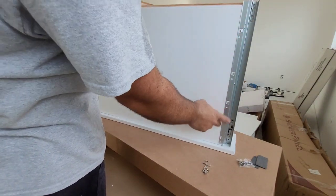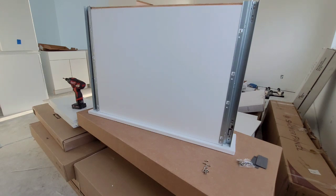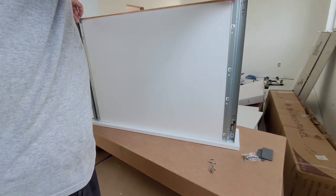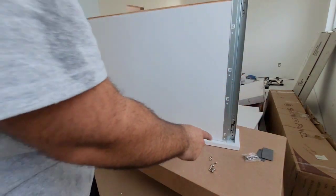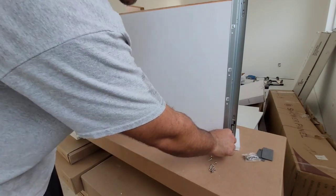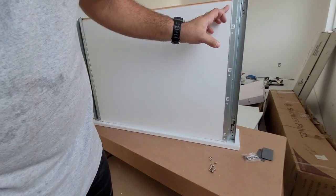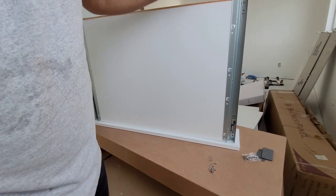Let's go over how to screw in the bottom plate now. You have to screw in all these holes here. However, if you screw this badly - if it's pushing the drawer or anything like that - it won't close right, and that was another issue I had on the first cabinet. The best thing I found is to assemble the whole cabinet, set it on its face, make it nice and square. Make sure your plywood is touching on both sides of this bracket and is to the edge of the bracket. If you do mess it up, you've got one chance to take it back out and flip it around because the holes are offset more to the front than the back. So you do have two chances at screwing this in right.